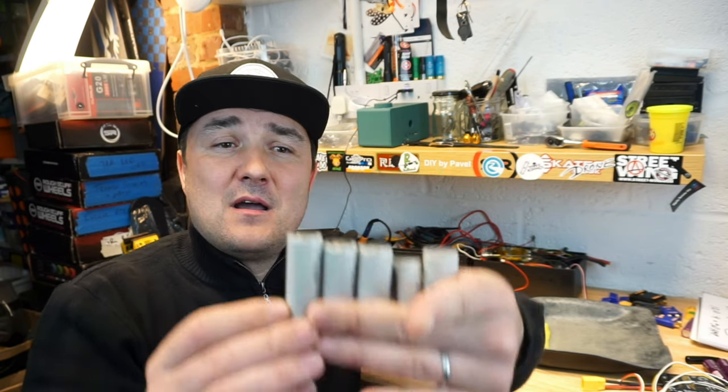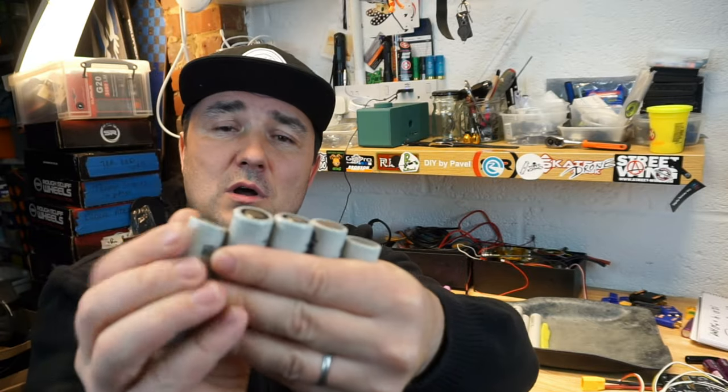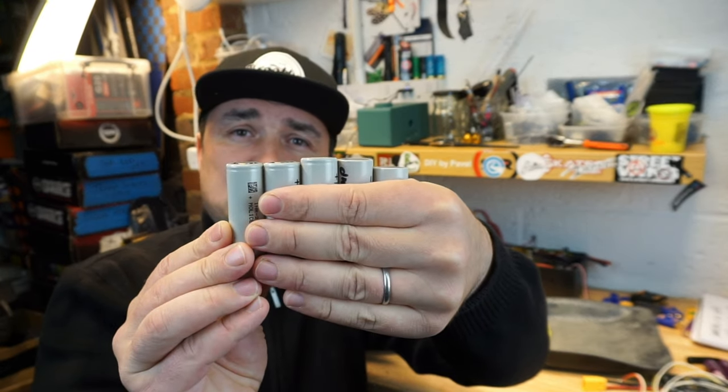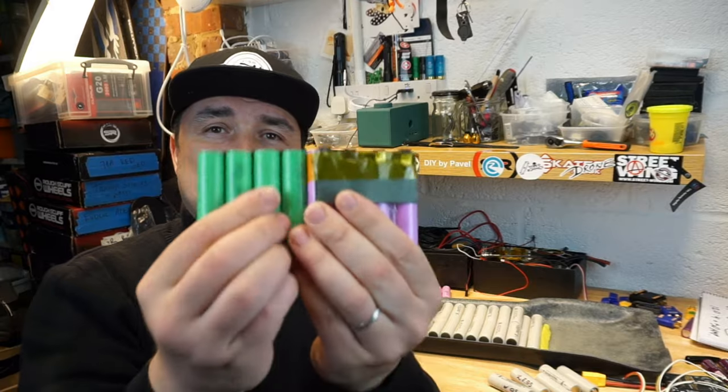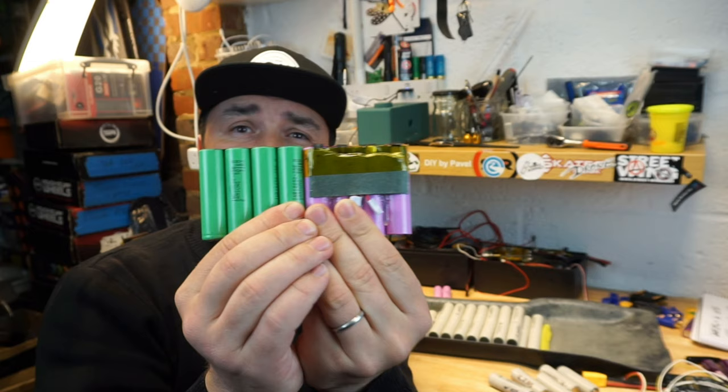So 50 volt, and it's gonna have 150 amp constant discharge capability. And look how small the pack is actually going to be compared to 8P with 18650s that will give me 120. You're with me there? So choosing a cell gives you a chance to manipulate the size of your pack and get exactly what you want from your battery pack.